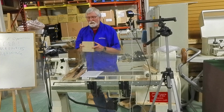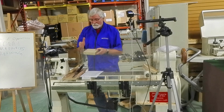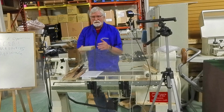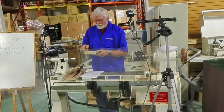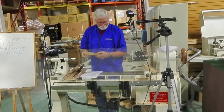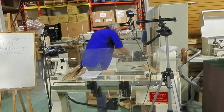So this thing, if you got like a chop saw or a table saw, you draw a circle, you can knock the corners off. And then you have 8 sides. 8 sides turns pretty easily. And you can take a little bit more than that. You could use a jigsaw, go around it. A bandsaw is way easier. You can use something like a compass.